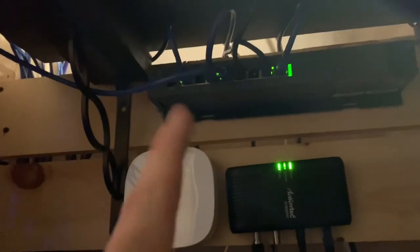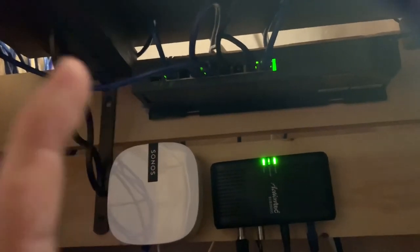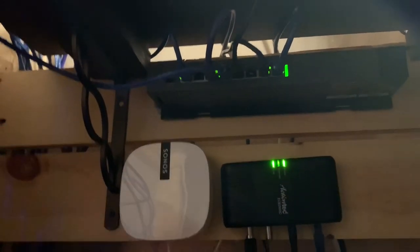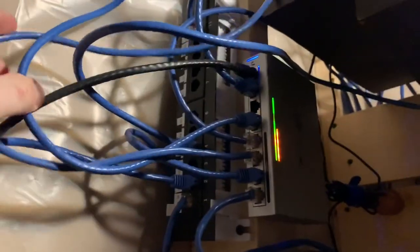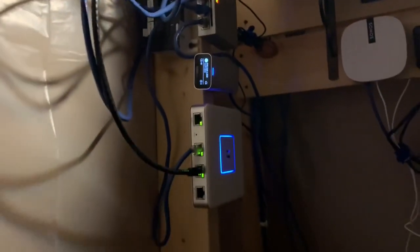Port 3 is open, and port 2 is going over to this unmanaged switch, which goes to the Sonos, my MoCA injector, and a spare. That's a layer 2 smart switch by Netgear running in dummy mode - even though there's an IP address attached to it, it's just there to supply extra ports if I need them. Tomorrow I've got to clean up the rat's nest, shorten a couple of cables, and relabel a couple of things. But after playing around with it all day, I'm really happy with how it came out.